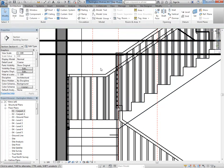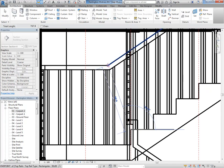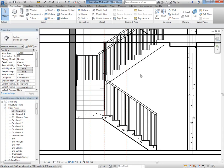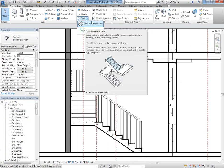The steps are flat but the railing is sloping, so at different points along the step the railing is obviously changing height. This railing is much higher than it needs to be — you can go much lower. Looking at 900, that's a lot more typical. If you measure from the corner to the railing it's 900, and from over here it's 900 as well, but from the corner of this step to the point here vertically it'll be less than that.